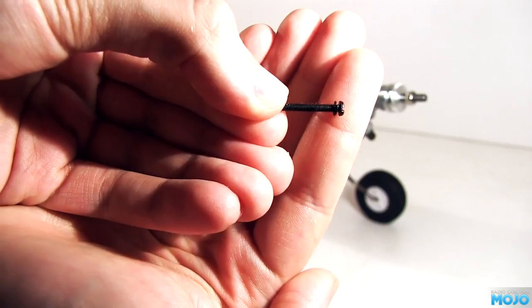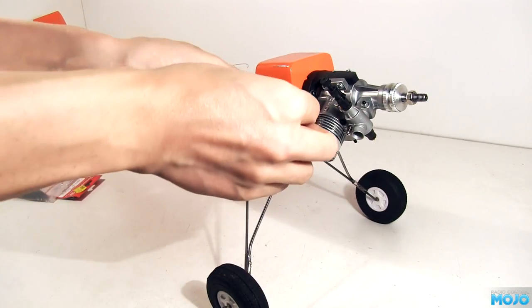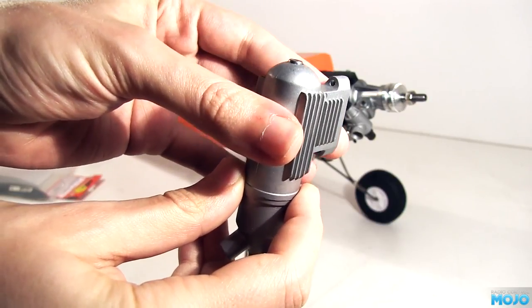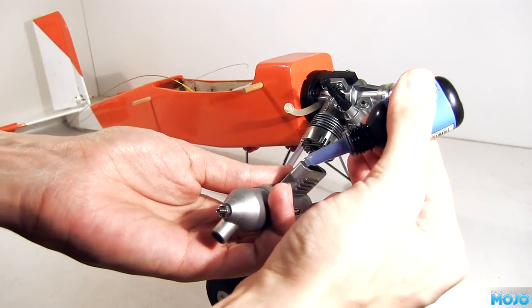The screws have spring washers on, which should stop them coming loose, but if the pipe has holes that are open-ended, I use a bit of Loctite. Just a little bit, with the excess wiped off. Going to use a gasket now too, as this will be the final install.